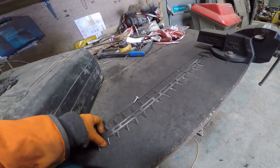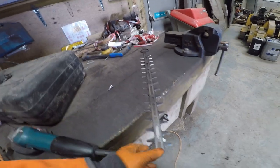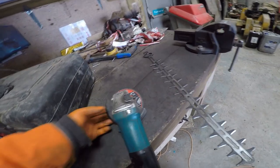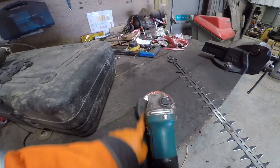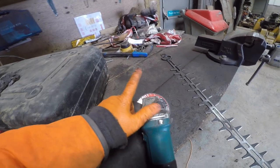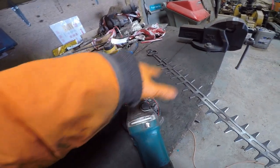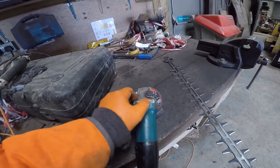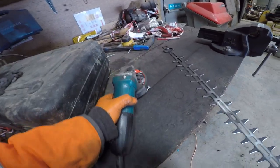I don't know how much you saw, that's basically doing these little short ones in real time. Notice at each stage the grinding wheel is used so that the guard is towards you and the sparks are going away from you, staying out of your eyes. Well, not wearing goggles because these are CE marked safety glasses.